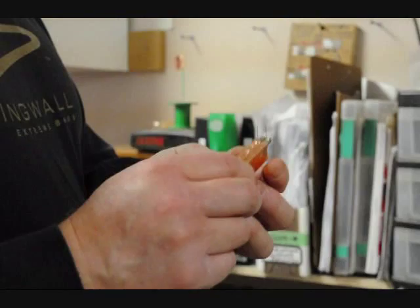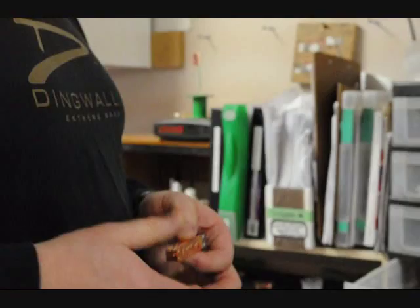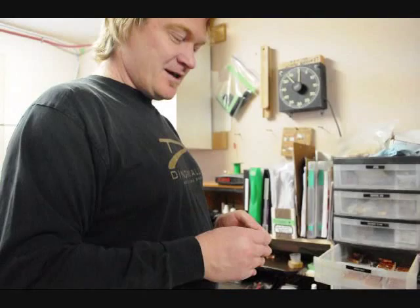Okay. And oddly enough, it makes more difference shielding the back of the pickup than it does the front of the pickup, and that's because the pickup is sitting close to you, and there's a capacitance coupling between you yourself and your pickup, and so you're actually grounding your pickup through the air and causing noise issues, or you're acting like an antenna for your pickup. So by shielding the bottom of the pickup, it decouples you from your pickup and you become less of an antenna.